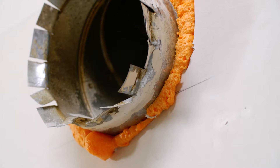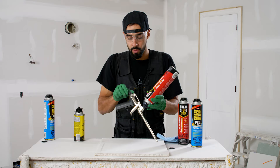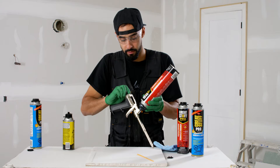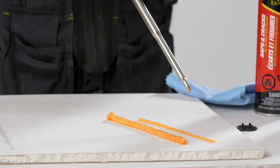To use the gun, take it out of the storage position — that's where the trigger is locked. To unlock the trigger, there's a knob on the rear that you loosen, which frees up the pin that travels down the barrel. One turn counterclockwise lays a small bead. Two turns counterclockwise and the bead starts growing. So the more you loosen that knob on the rear, the larger your bead gets.